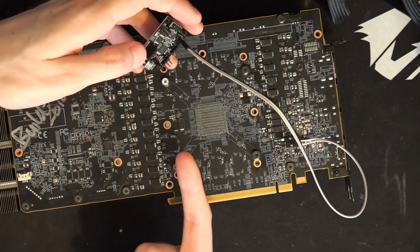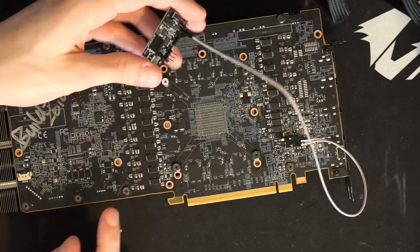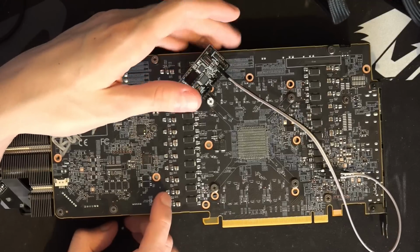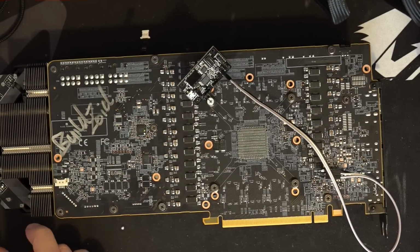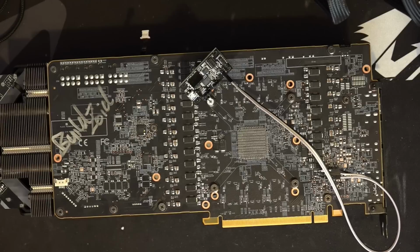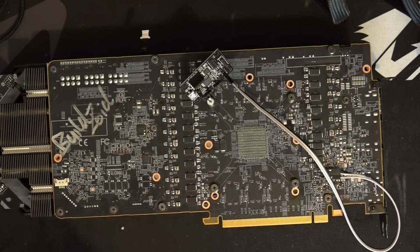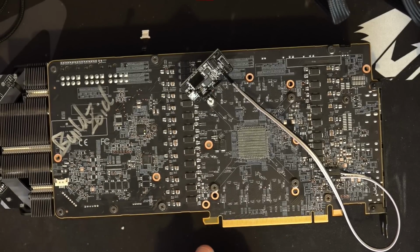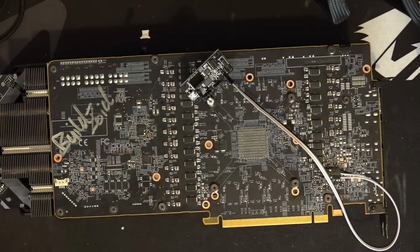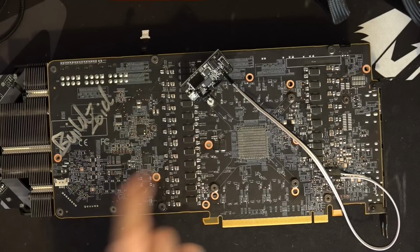The reason this is the most useful modification for competitive overclocking is that this thing, even on air cooling, scales. For the Firestrike Ultra run, I was running plus 88 millivolts VCore, so my max voltage was approaching 1.3 volts at that point. GPU-Z was reporting close to 500 watts of GPU power draw for graphics test 1, which is the really, really hot one in Firestrike. So yeah, the card scales with voltage even on air cooling. So you really want an EVC.